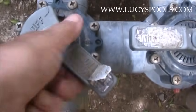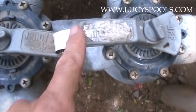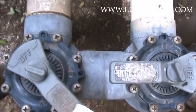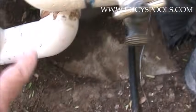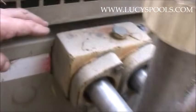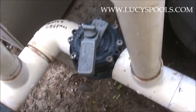With a two-horsepower pump the valve is usually in a different position. Note that sometimes manufacturers put these valves so close together — if that happens, you can just cut one of the handles right there to give yourself some space. With the cleaner, about half open is enough for it to work well with a three-horsepower pump. Then we go into the pump, coming out here. I put a little arrow going into the filter — it even says 'inlet' — and then it comes back out. Here's where it gets interesting: this long pipe goes to the inlet of the heater, and then it comes back out. In between, there's a bypass valve.